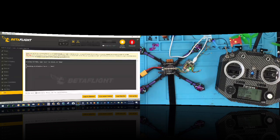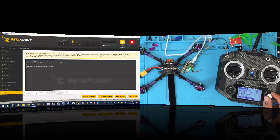So the first thing we want to do is power up. I'm using a power supply. And then we're going to look to see what we can get here, right? So we've got a solid 5 volts now, and we've got a strong signal, obviously. So now what I want to do is in Betaflight, I'm going to go to set TLM, and I'm going to select, let's see, we'll start with half duplex, hit enter. And right now the default value is, I have it as off, the default's on, I actually did that backwards. So make sure it says on and leave it as default and click save.